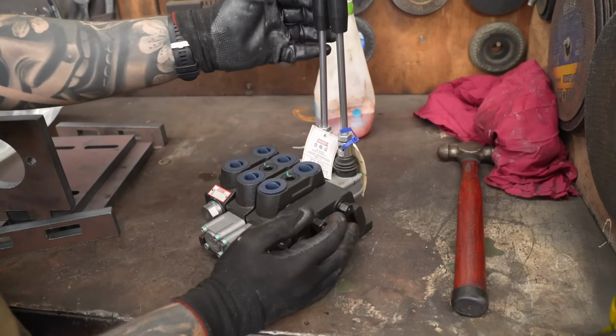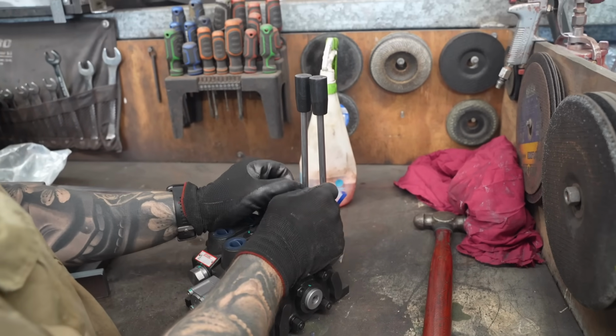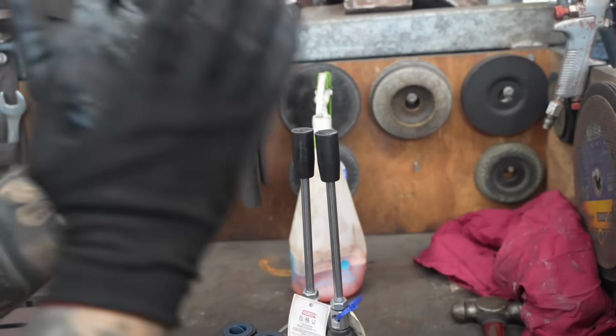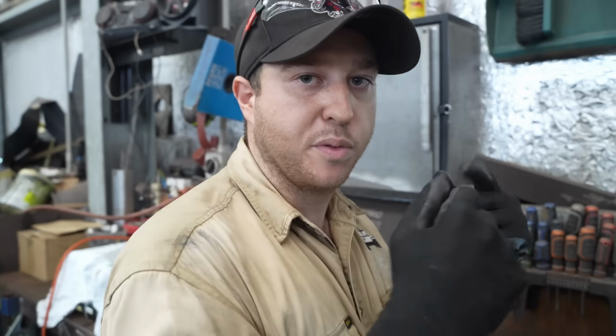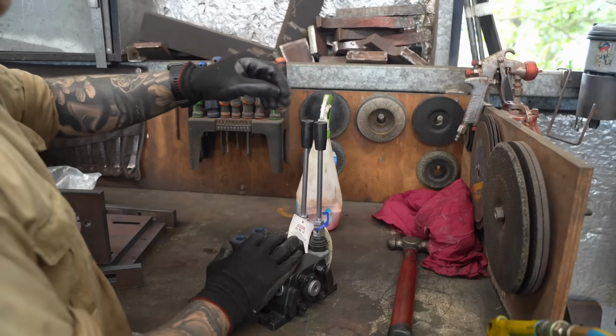This is our hydraulic steering. The driver will have this underneath his legs. We're actually going to bend these out and give us a little bit more room. Push both forward, and the tank will drive forward on both tracks. Essentially, it's very much like a Bobcat. Or an excavator or something like that. It's the same thing.